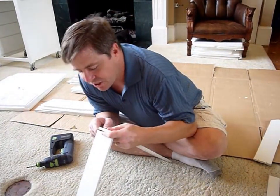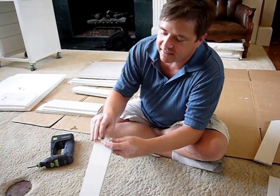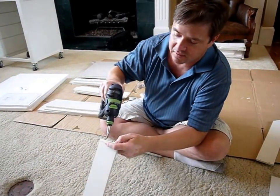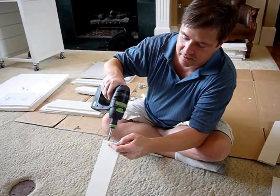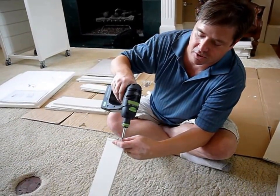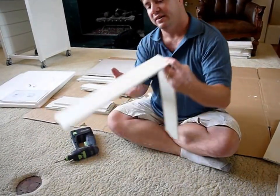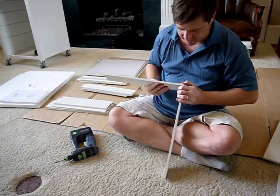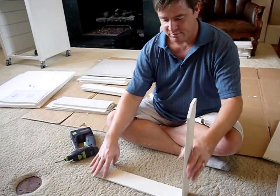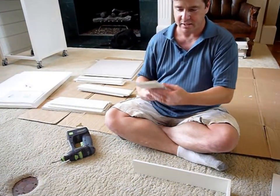The way you can make sure you're good is by giving just a little tiny bit of finger tightening into those pre-drilled holes. And you want to be somewhat gentle with your electric screwdriver. You do not want to overscrew these. It is into solid wood. However, it is not a super thick, super robust sort of material.